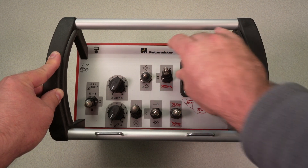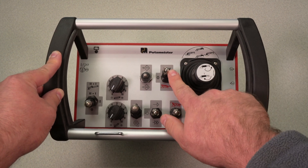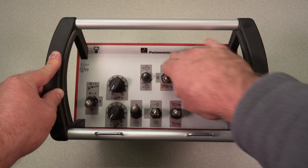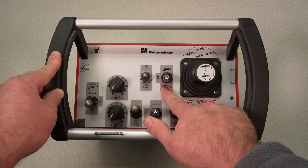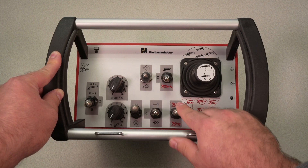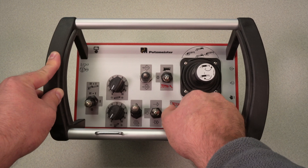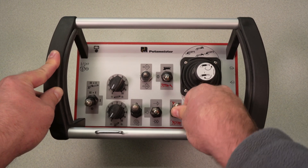In order to get any main belt or feeder belt operation, you must have this switch into the boom position. In order to operate the transfer function, you must have the selector valve in the outrigger position. This is to lift the transfer. This is to lower the transfer.